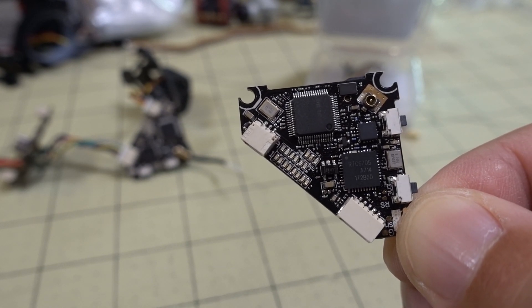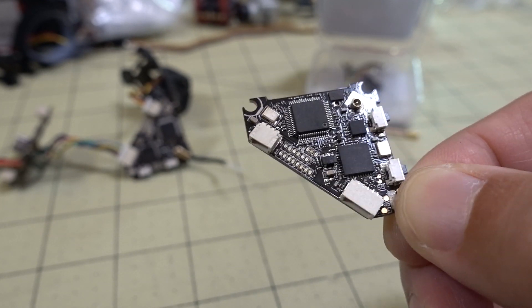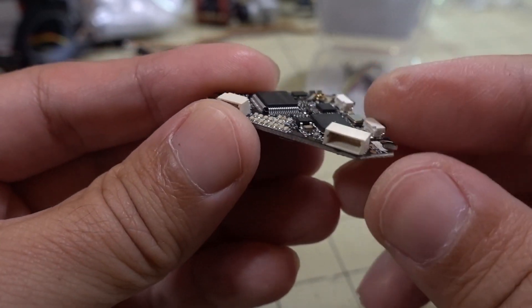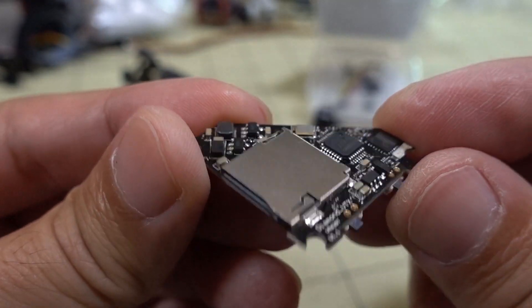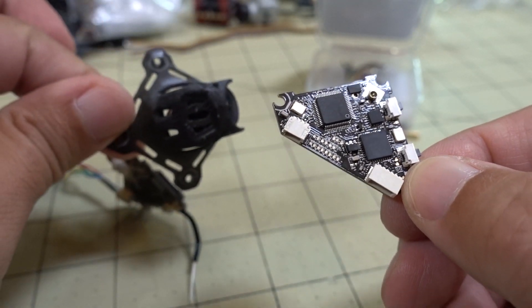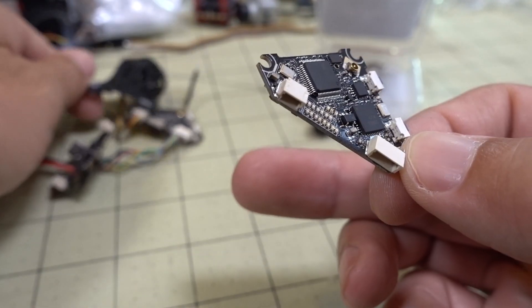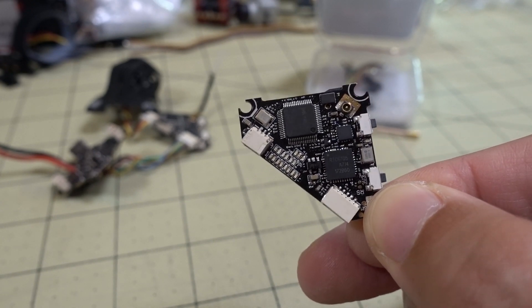This video covers the Diamond VTX and some tips for getting better results out of this VTX/DVR combo. First off, it runs pretty hot on 200mW because it has a lot of small, tightly-packed components. With the video transmitter running and the DVR recording, this thing gets very, very hot. I've been flying it on my Lava X, which has vents for air cooling that keep it cool while flying.